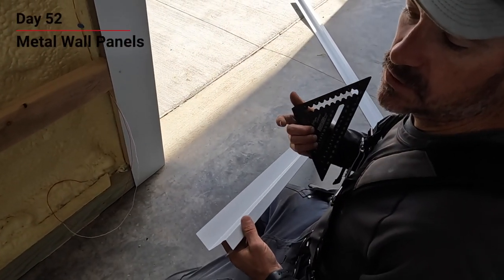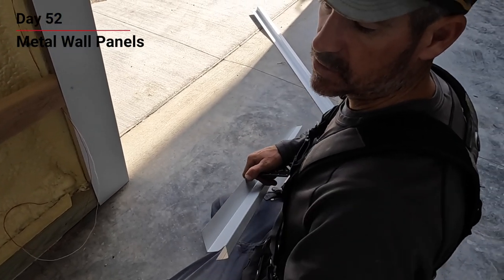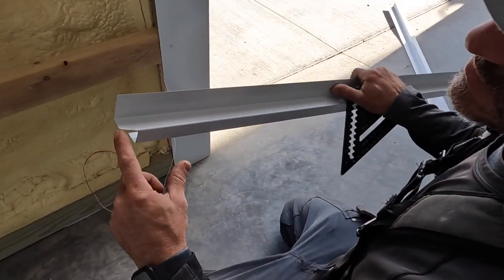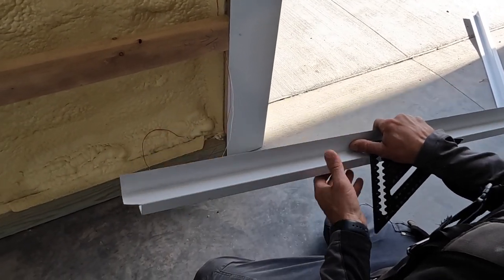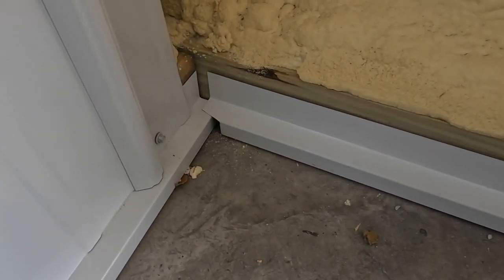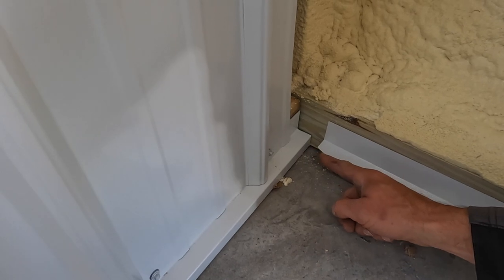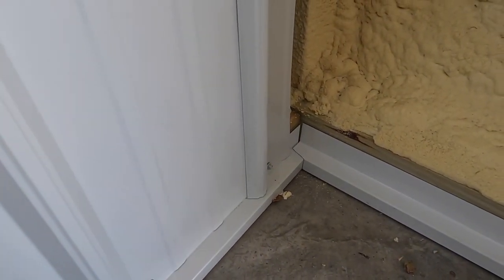All right guys, if you don't do a one piece inside corner, you can just run one of your square bases all the way in. Then you have to take out 1 inch on the bottom and the front, and put a little angle cut. Then it just slides in there just like so. So take one all the way to the corner, notch an inch out, make a little bit of an angle, and slide it in there. That's a two-piece inside corner.